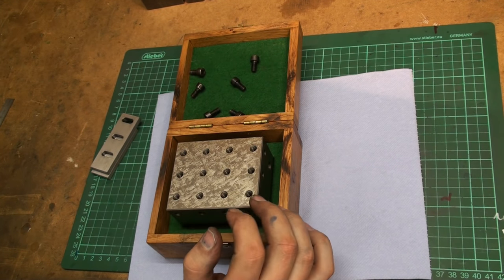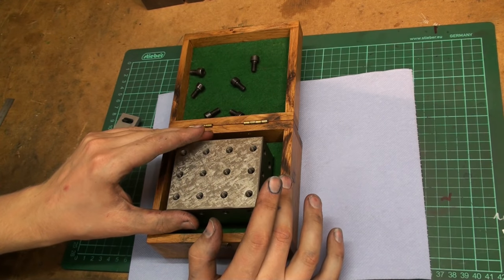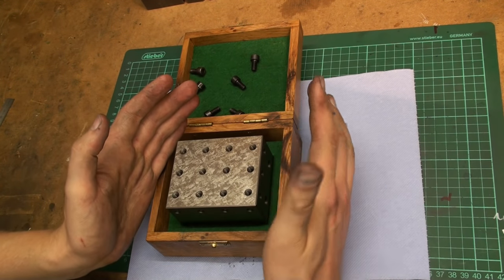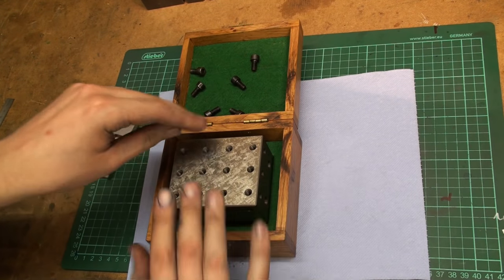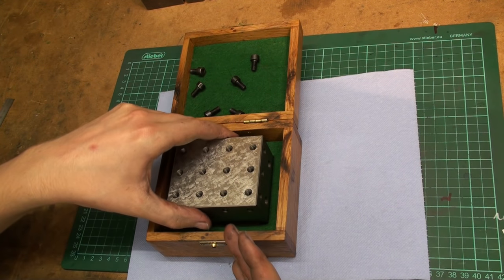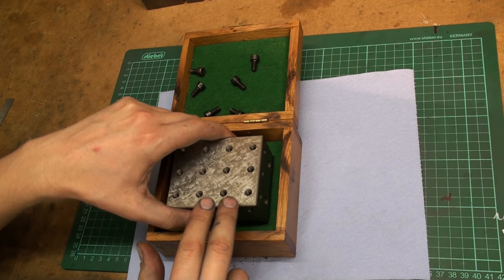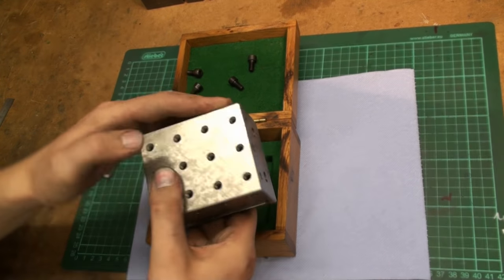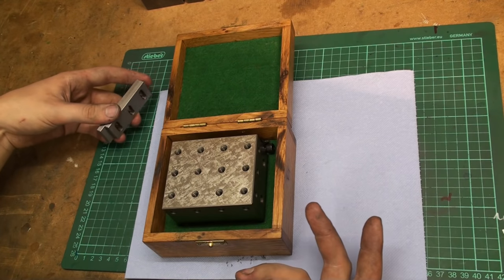I saw this in, I think it was the first Bedside Reader by Guy Lautard, and there was this toolmaker's block. His version is a bit bigger, if I remember correctly. And I thought at the time, this is a great project to learn how to scrape a block on six sides, square and parallel. And it is. It took a really long time, but I got it done, and it's a real neat thing to use. You can use it in every direction, it's always square. So this is one of my older projects. This was way before I did this YouTube thing.